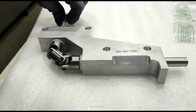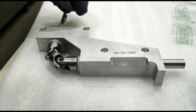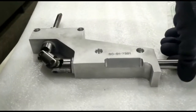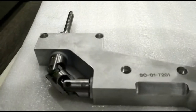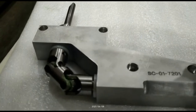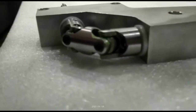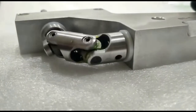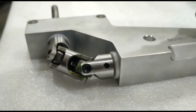Double universal joints can be created from two single joints by pinning or butting the hubs together, or by specially designing the double joints with a single center section to eliminate additional machining and assembling. Compared to single universal joints, double universal joints achieve higher operating angles, up to 90 degrees, provide added length but are more compact than drive shafts, and have the same accuracy as single joints.